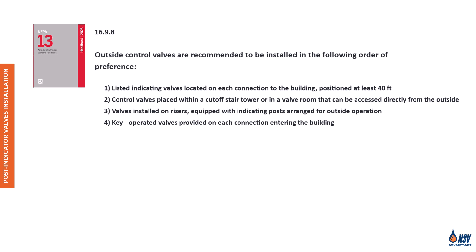They also provide a convenient way to shut off the water supply during emergencies or routine maintenance. During a building fire, an exterior wall may collapse and damage underground water mains. In such cases, a post indicator valve enables firefighters to isolate and shut off water to the damaged areas, helping maintain proper water pressure and preventing water from being wasted or diverted away from where it's actually needed.